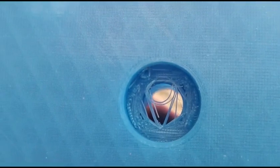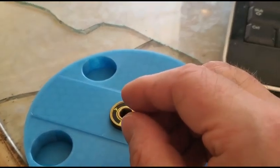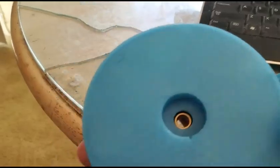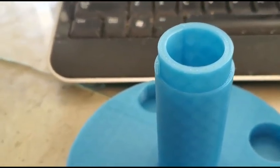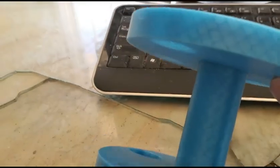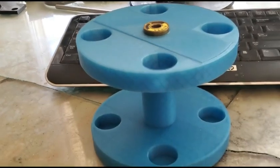So what I did is instead of making that a quarter inch, I made it like an eighth or a sixteenth of an inch — just something to stop the bearing from going in and keep it level. One thing that worked really well: you've got that little groove there, you've got that little nubbin. This thing only fits on in one direction, and because of that groove and the place where it has to go in, everything's lined up perfectly.